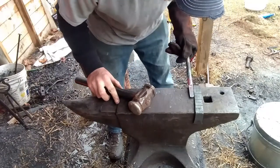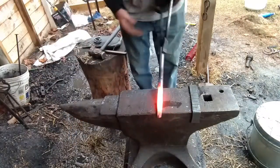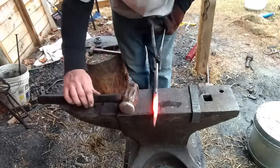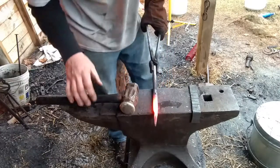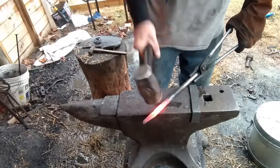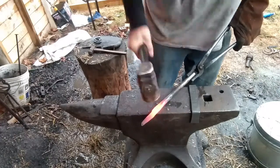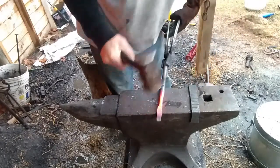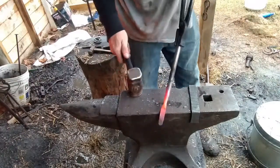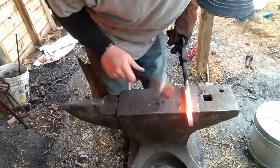Let's see what we've got for the wings there — about two inches. Now we start it here like this. We're going to go across our anvil, the opposite face goes 90 degrees, turn it over to a 45 with the face of the anvil, and set it down there — half on, half off the edge of the anvil. We created that 45 right there to keep it clean.